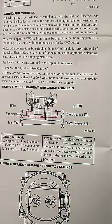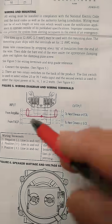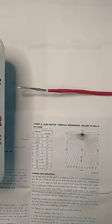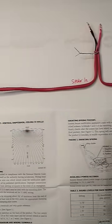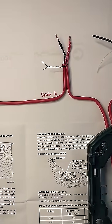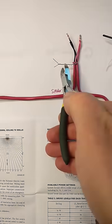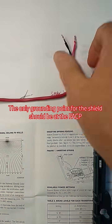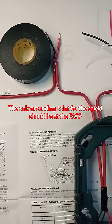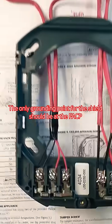The instructions don't tell you what to do with a shielded cable. As shown here, you're going to need to connect that shield. You'll have shielded cable coming in for the speaker, and if you need to make a splice anywhere, make sure you twist that shield together. You can cut that off, bend that down, and insulate it well with electrical tape as shown here.